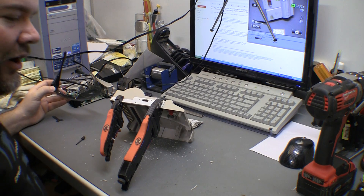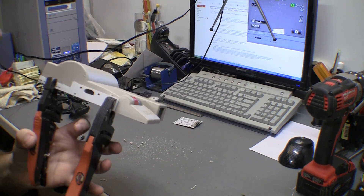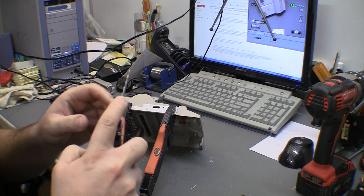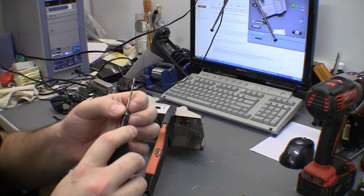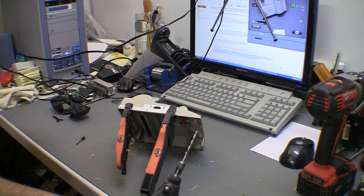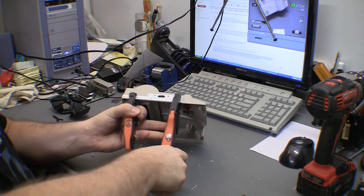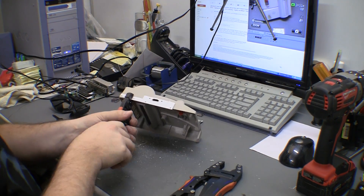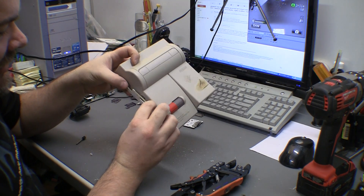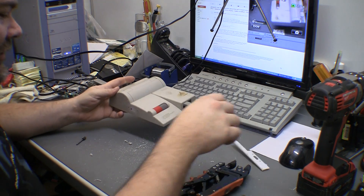Well, that went awful - so terrible. It was cutting right into the fiberglass of the template, which I kind of expected. I wanted to keep it down right there about where it transfers from a solid shaft into the flutes, the cutting flutes, and I didn't quite figure that out right away. It was just catching in all different directions, going all over the place. So that's definitely a failure. He's looked into it further and thought about having a spacer in between so that it sticks out a lot further, so we can do that a little easier.